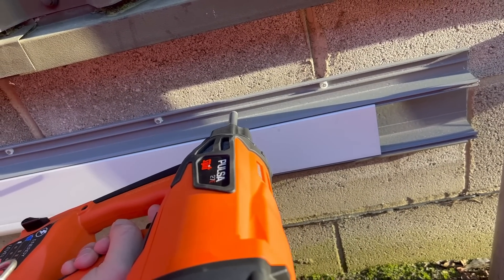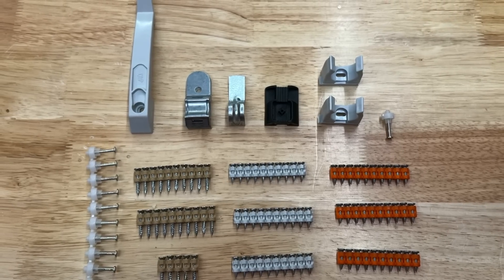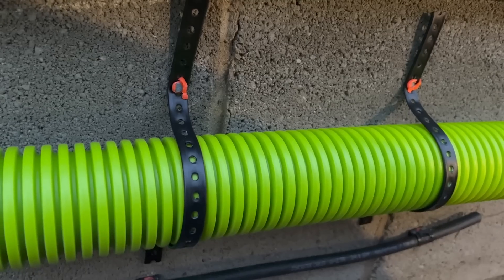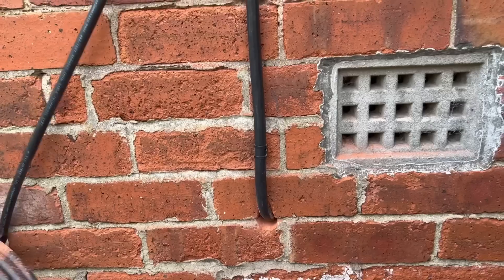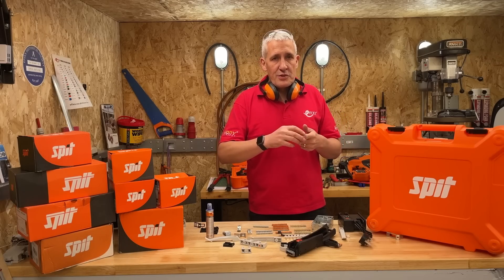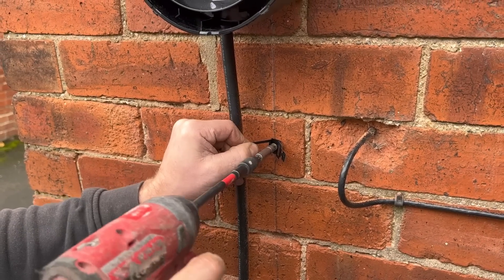All of the equipment we've shown being fixed used 17mm pins, and you can step up with this machine all the way to 27mm. You can use the pins with lots of regular electrical accessories just by trial and error to see what's suitable. We found them particularly useful fixing all-round band for ventilation pipe, but also D-line clips that are popular with EV charger installers to create that invisible cable fixing look. EV charger installers are always under time pressure, and that's probably one of the main reasons to choose this tool — Spit claim it's up to eight times faster than traditional fixings, and I think we can pretty much agree with that.